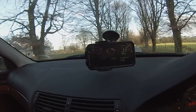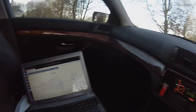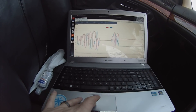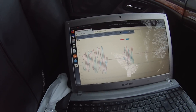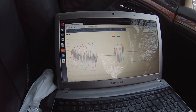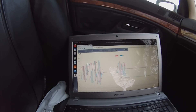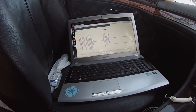I'm back on the throttle, trying to accelerate now, and I've tripped out. You can see we got to some 400-amp peaks. I've got manual brakes at the minute because the brake pump isn't rigged up yet, but I got about 400 amps there and the car really felt sluggish. Not quite sure what's going on here — this is the joy of tuning unknown motors.